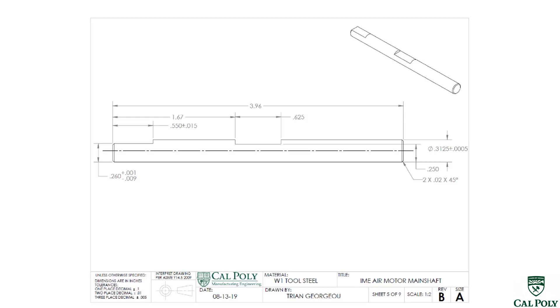So we're going to start off with 5/16" drill rod, and we've got to figure out how we're going to manufacture it off of a four-foot stick. It's a common size that drill rod comes in. The traditional machining process to cut our blanks is sawing. We're going to use a cold saw with a steel blade with a really small tooth spacing in order to cut the stock to 3.96 inches in length.